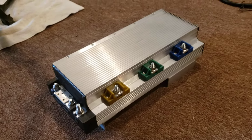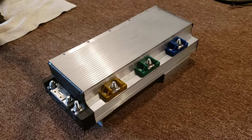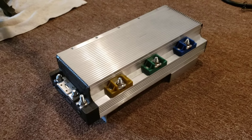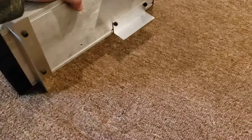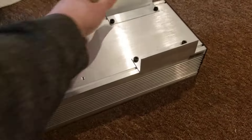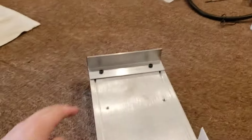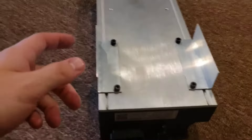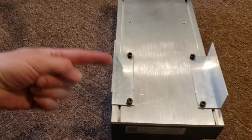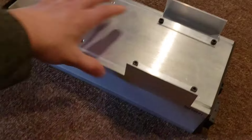Here's the motor controller. I'm going to share how I'm going to mount this motor controller up against the frame. If I flip this over, I've already installed L brackets here — one across the top and then two on the side — because I'm going to have a rod going through here, which I'll show you where that's going to be placed on the frame.